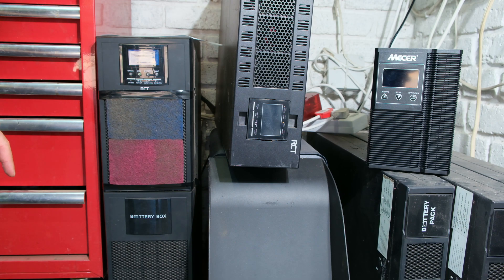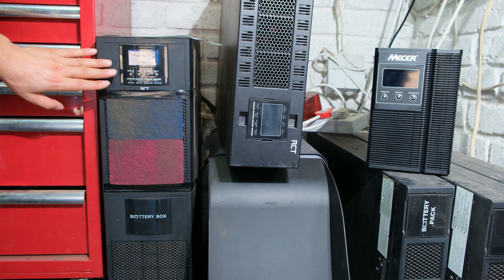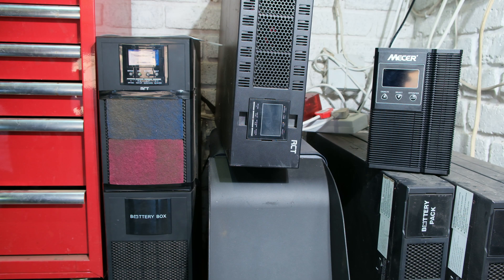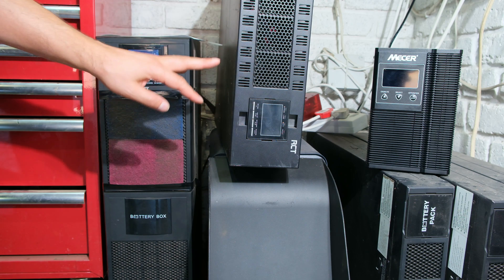To answer the question: are these good for load shedding? No. You're going to end up buying batteries after batteries, and the cost does not justify it. However, if these are in a computer room or server room and the power goes off, you've got enough time to power down your servers - these are not designed to run for hours with no power. But if you want to use them to clean your power from the generator and protect sensitive electronics, these are great. In their defense: good for cleaning power? Yes. Good for load shedding? No. I've had correspondence with the product manager of Rektron who said batteries are decaying because of load shedding, but I've been using these since 2018 with little load shedding and battery life still decayed. Load shedding just makes it worse.